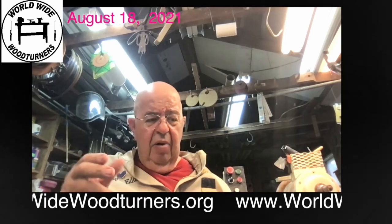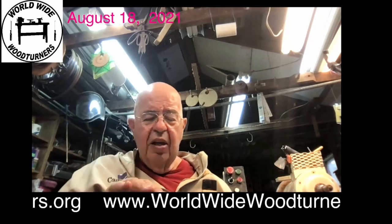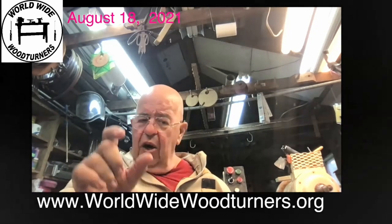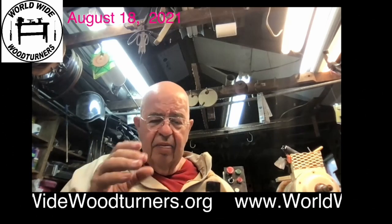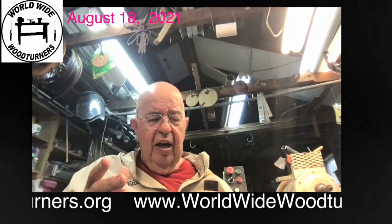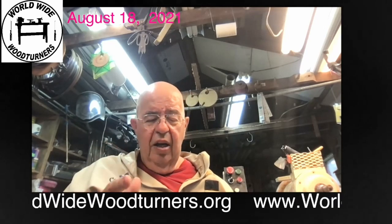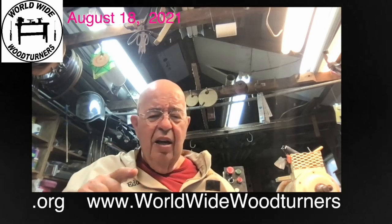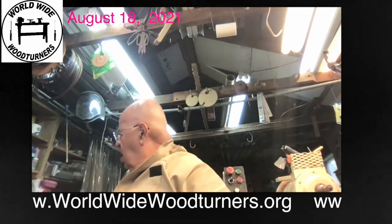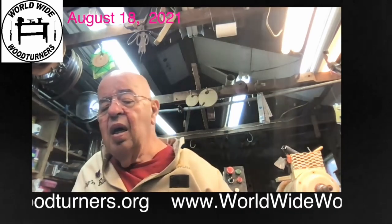You'll see the highs and the lows and the scratches and all that, because you're working with a little bit of piece of wood. So if you have that semi-finish on, that'd be nice, I'll say that. It'll enhance flaws. It'll enhance them, and then you go back and work on them again. What I'm saying is black palm chips out so badly with the grain, I wound up putting super glue on it to hold it together so I can turn it.